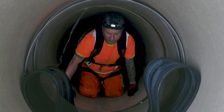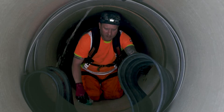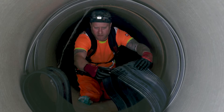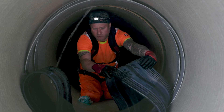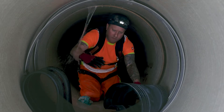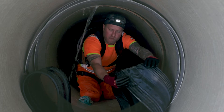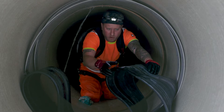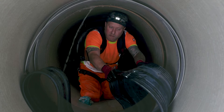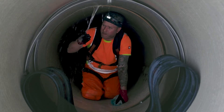Installation of an AMX 10 mono seal. With the mono seal we seal from pipe to pipe — there are three double-sided sealing lips on each side of the rubber. When we place a pipe on each side, we're allowing the pipeline the flexibility to move underground, because pipelines do move. The AMX seal gives our clients confidence that their pipeline can have that slight movement and the seal will go with it.